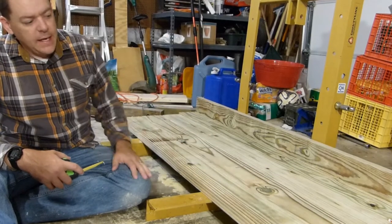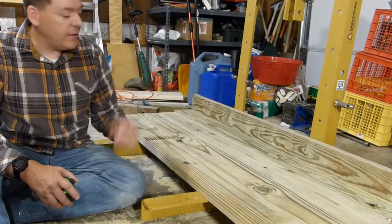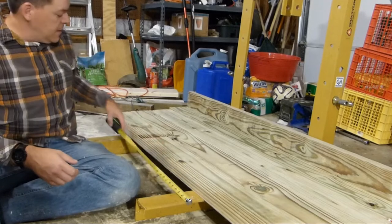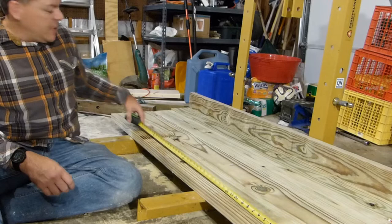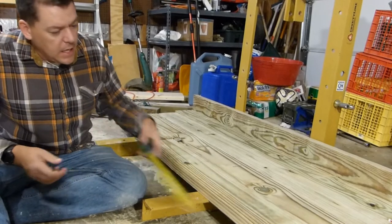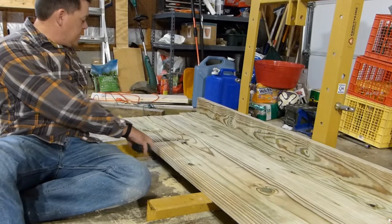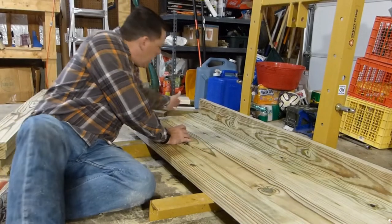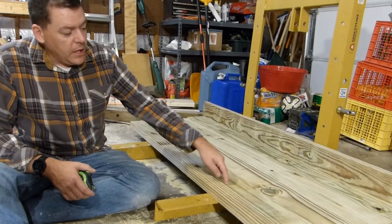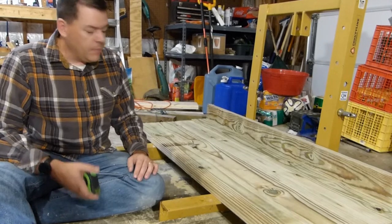I'll have about the same height, and I'll put some small sides on it and then some tool racks and other things so we can carry around what we need around the farm. The next thing I need to do is mark up where these boards are going to align with the frame on the base. These supports are 32 inches across and my boards are 60 inches, so 60 minus 32 is 28, meaning I should have 14 inches on each side. Lining them up — that's right on, and that's right on. So next I need to pre-drill these boards to align with the holes in the frame and then I can put my carriage bolts in.